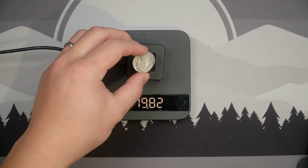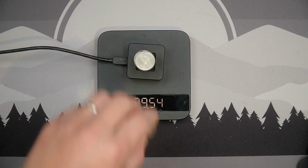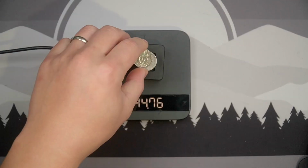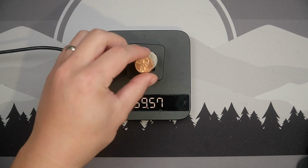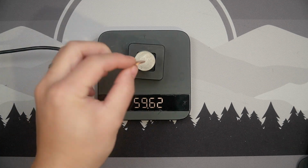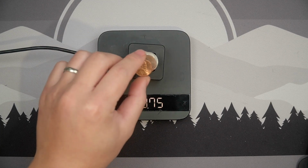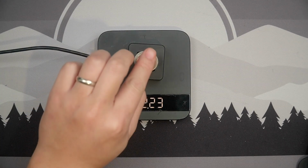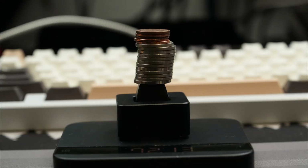On the screen right now, you're seeing my actuation force test, which stacks nickels and pennies until the key actuates. Nickels weigh just around 5 grams and pennies weigh roughly 2.5 grams, so it's useful to get a ballpark measurement of the actuation weight. You'll hear that dreaded via spacebar thump right at actuation, which happened in my 3 tests around 64.2 grams on the switch I tested after adding the weight of the SA keycap, which itself weighs 2.2 grams. A big part of the heaviness that's perceived with these switches is the bottom out weight, which I tested off camera at roughly 74 grams.